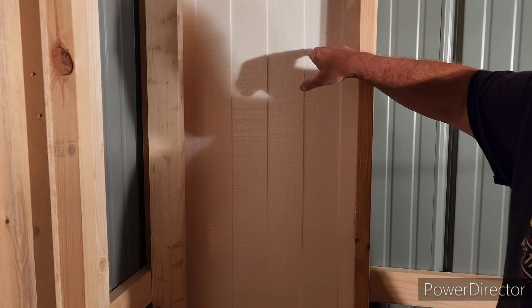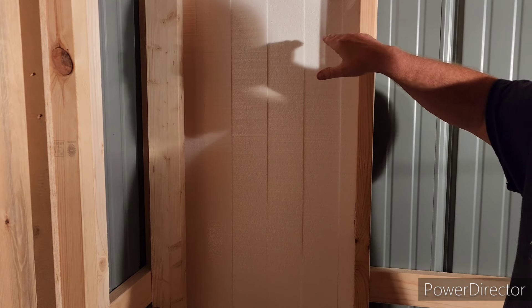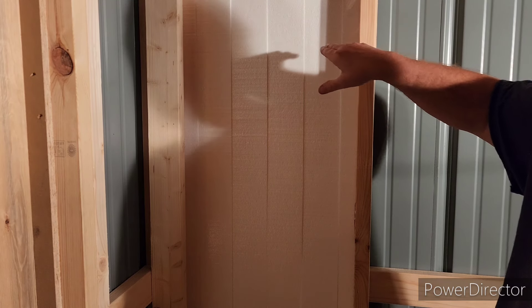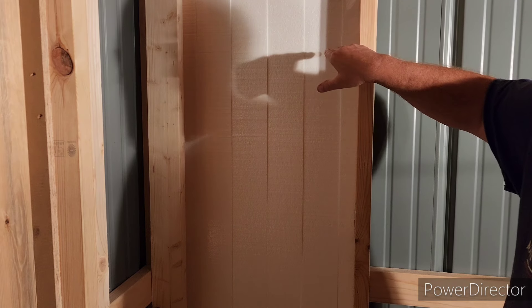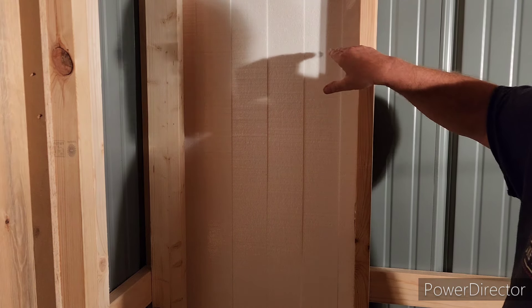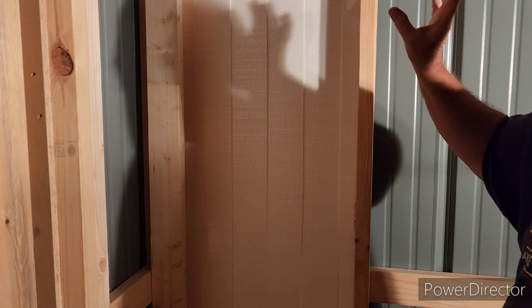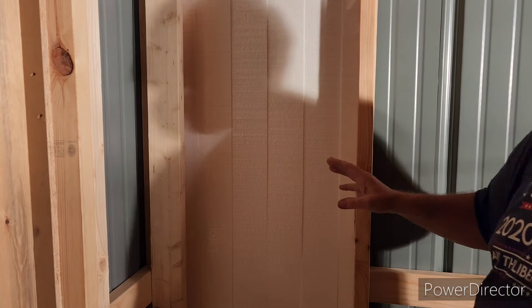Same with under my floor — my house has twelve-inch on-center floor joists, so I'm going to cut pieces at ten and three-quarters inches. I've been experimenting today with this foam, and ten and three-quarters will wedge up in there just perfectly and stay right up in there.